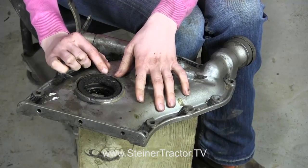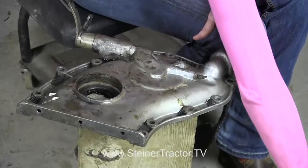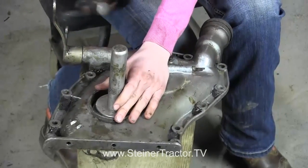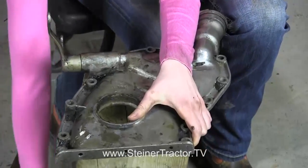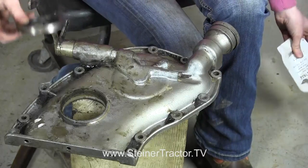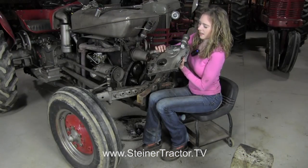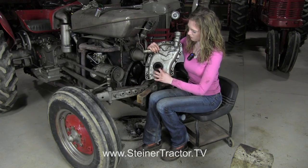While we're this far into the process, we're going to go ahead and replace this front crankshaft seal. There's some felt here that you'll want to take out and remove, and then the seal is beneath it. I'm just going to use a seal driver that will fit right in there and tap it out. Here's our seal — our old one you can see is kind of damaged. Our new one is a double lip seal, a new replacement part from Steiner, and you can also purchase a brand new felt which we will install.